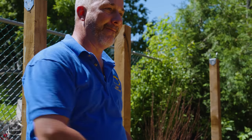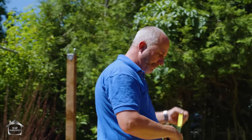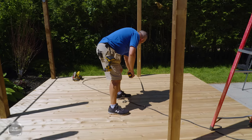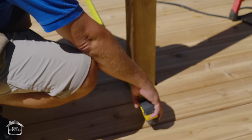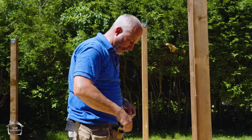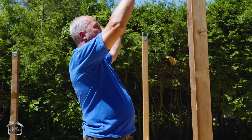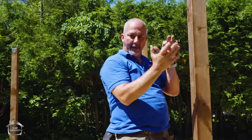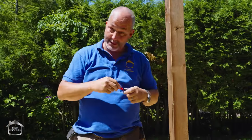I just need to make some beams now — this is going to be quick. To make beams, measure at the base outside to outside. In this case, 113 and seven-eighths. We want to make our beam exactly 113 and seven-eighths so that when we put it in, we go flush on each side. Any little oddities in the way it's sitting, there's still a little bit of flex — it'll work itself out in the wash.